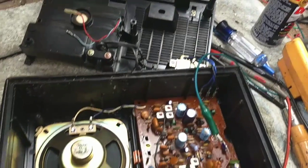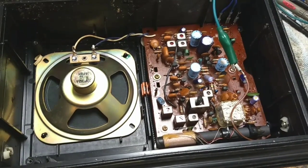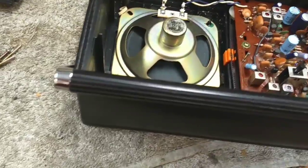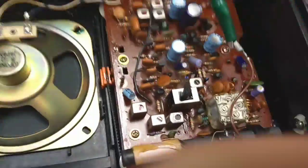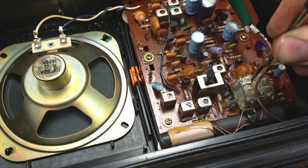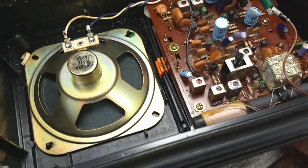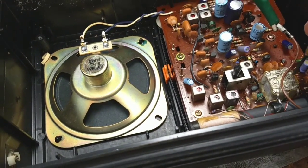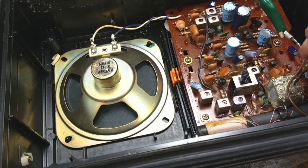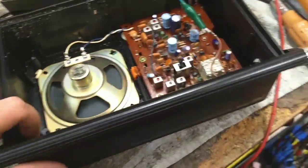But what let's do is, let's turn the output of the signal generator down a little until we start to hear some noise. See if we can improve sensitivity a little bit. Excuse me here, just going to move things around a bit. It's your oscillator, obviously. These two are probably your AM, so I'm not going to mess with that. It's already pretty good as is.